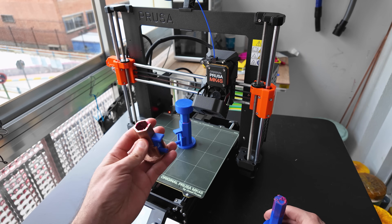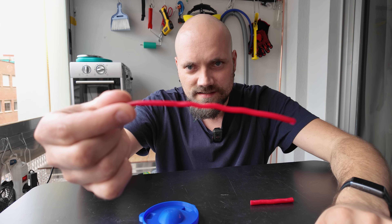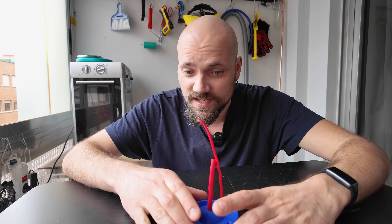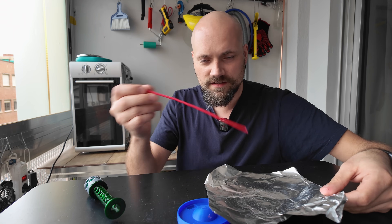You might say the sprues are too soft, but for me as a hobbyist it doesn't bother me. Sometimes I even like the fact that they're soft because you can just shape them with your hands — you don't need a soldering iron. This sprue is obviously quite soft; if I hold it by the end it does bend. But you can still attach it to both ends and it'll keep its shape as long as there's a main sprue. You can also stick the sprue in the freezer for just a few minutes to make it much harder, then work on your model. If necessary, stick the whole model in the freezer again before making your mold. Let me get the sprue I put in the freezer for 10 minutes — you can see it's much harder now.